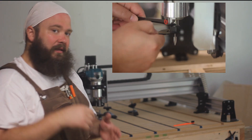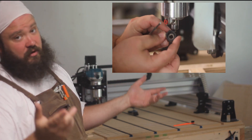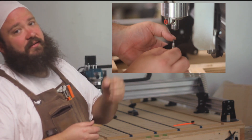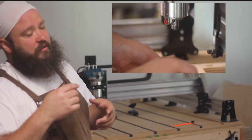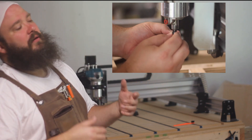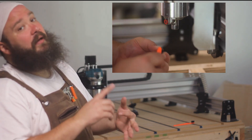Next part: cleaning your collet and router. If your collet's not clean — you get sawdust in there, just dust in general — it works on compression. It cannot make a tight fit if there's a bunch of sawdust in there, which can cause your bit to slip down or up depending on what you're working on. So every time I get to my machine, I check the nuts, I check the wheels, I clean my collet.